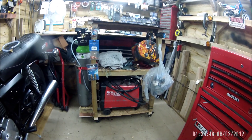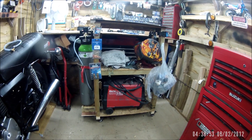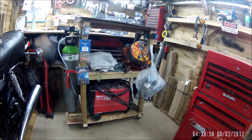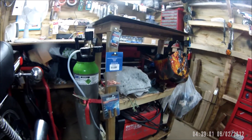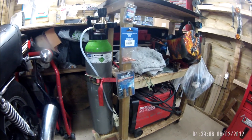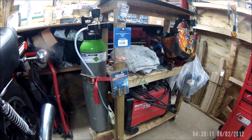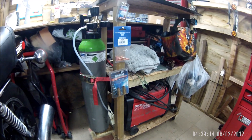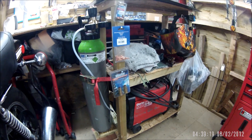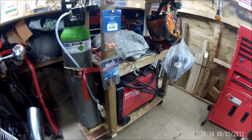Hello Mark, here I am on a Sunday afternoon doing a video as requested by you of the new setup for my Clark MIG welder — the new 20 litre 200 bar gas cylinder of Argon 5, which is a mixture of 93% Argon, 5% CO2 and 2% oxygen, which is meant to be a perfect mix for MIG welding of steel — thin steel, that is.